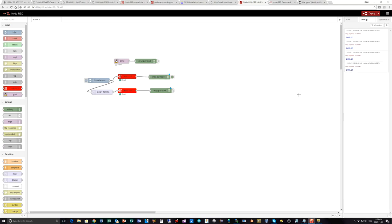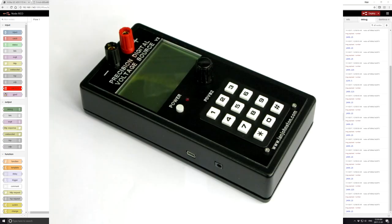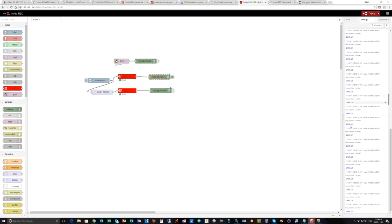I've hooked up a precision DC voltage source designed by Ian Scott Johnson in the UK — I'll provide the link in the description. It's a very useful and very accurate device. Right now I'm inputting 2.5 volts to the ADC, and as you can see it's giving us a very accurate 2.499 volts reading — very, very good. So the ADC is reading from the I2C bus at address 0x48 via Node-RED. That's working very well.